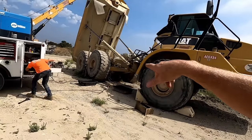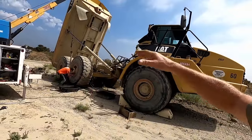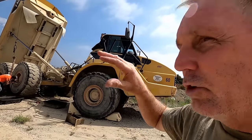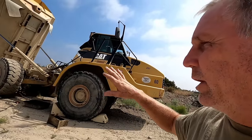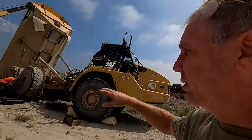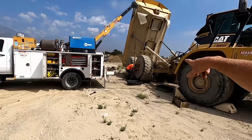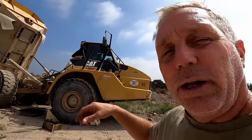We set the side we're working on to the high side — there are two reasons for that. I jacked it up pretty high, which is going to help contain most of the differential oil so when we pull the axle shaft we don't lose all the oil. Also, when we go back together, the way these wheels go on and the way the hub goes in, it's going to make it easier to work in. If you get one broken down on a hill you need two come-alongs and it's a lot harder. This way everything's going to slide back in. He's pulling the nuts off the wheel right now, then we'll get the wheel hook on and pull the wheel off.